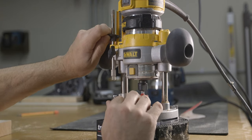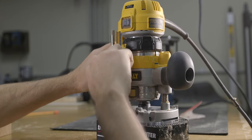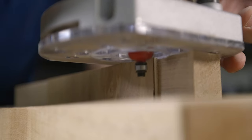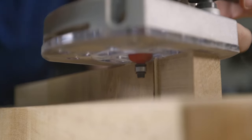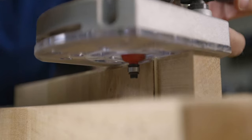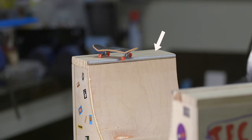The second way to make a climb cut is more of a freehand style, and I don't always recommend this to those that are new, but it works well. With this method, instead of adjusting your router multiple times, you can set the bit to your finished depth and then make multiple passes freehand, slowly working in to your final depth. I started by making the first pass light, just scoring the material, then made consecutive passes allowing the bit to go further and further into the wood while keeping the router under control with a firm grip. The project that gave me the idea for this video was a toy skate ramp that the kids and I made, which required us to make a cove profile so they could fit the rails on the ramp — and this freehand method worked really well for the cove bit and that small project.